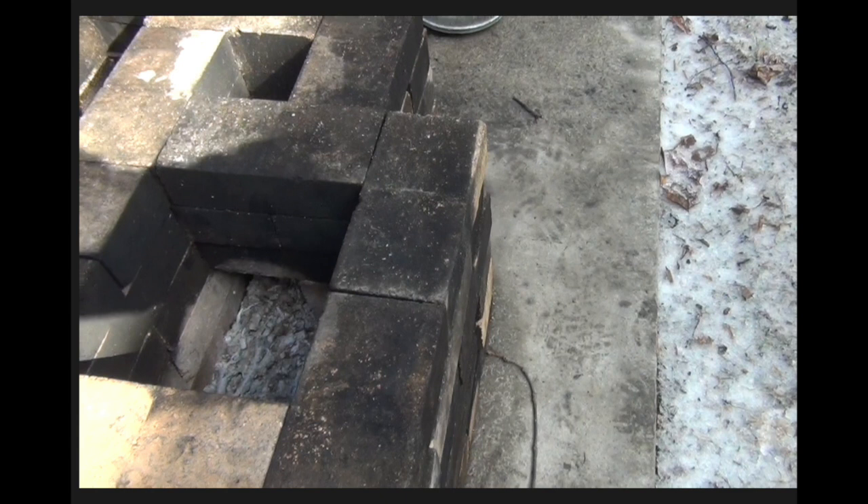If I was literally making a rocket stove for my home here, I wouldn't cut it so close on letting the flames get into the riser. I only have a half-brick by two-brick opening. The fire bricks are nine by 4.5 by 2.5. This is like a batch box port, but it's tiny. You don't have to have your port at exactly a certain number of inches. If I was doing this for my home, I would go one half-brick by three high, just to let the flames come into the riser a little bit more easily to avoid any sort of backup. That's why the entrance to the riser was very small - I was trying to accomplish something here.